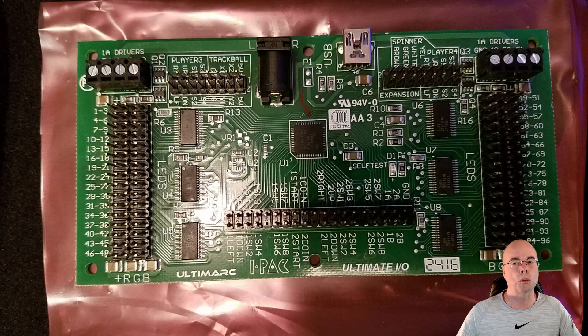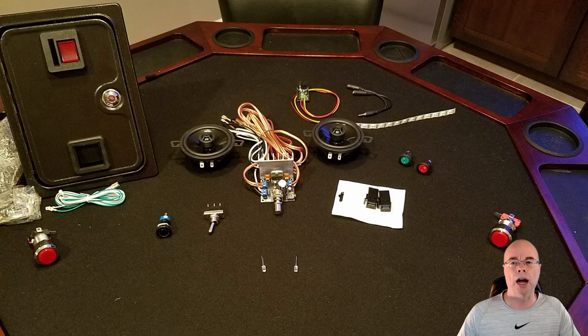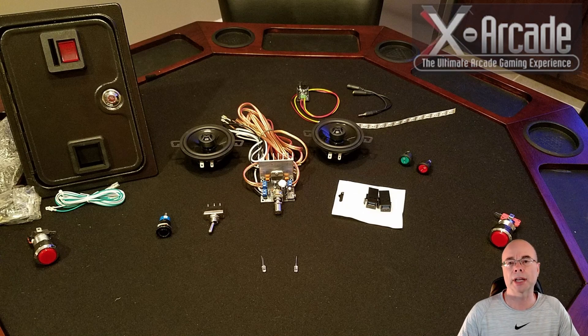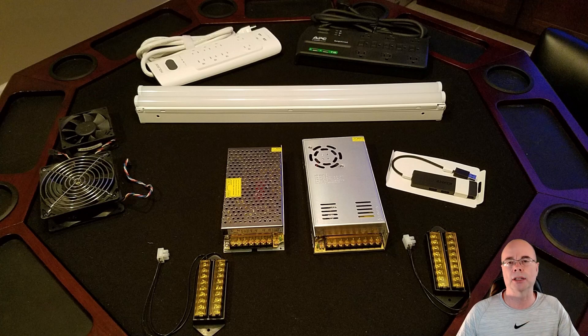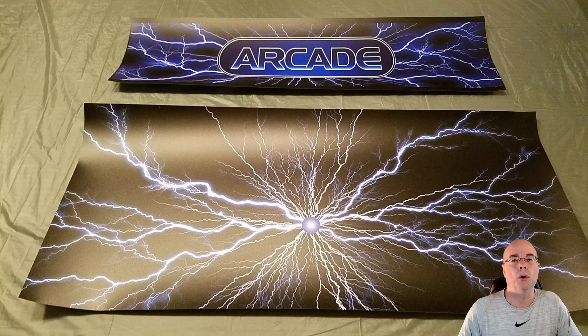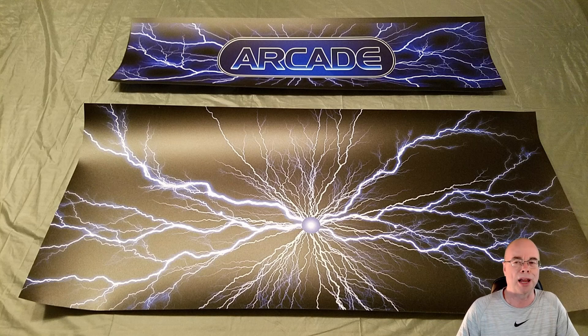This is the iPac — it's what allows all those controls including individual LED button control. This is the joystick that has a servo and a restrictor plate allowing me to change it from four-way to eight-way — those were big key components of the control panel. I also had started ordering other parts: I got my coin door from a company called X-Arcade, ordered some speakers and other miscellaneous parts, power supplies, lights for the marquee area, and I went ahead and ordered my graphics from a company called Games on Graphics. I'll leave links to all these companies below — none of them sponsored this video. You can design all your own marquee or graphics; they also do vinyl for the sides of your cabinet with predefined templates, but you can also custom-design your own.